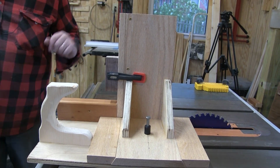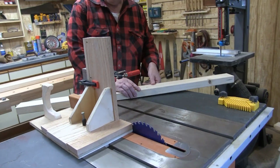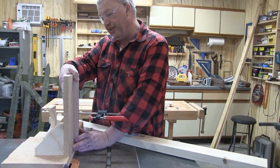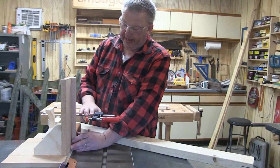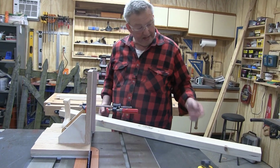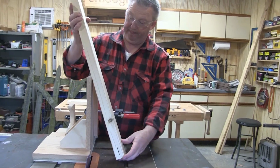And so if you come around here, I'll show you the setup on this side, and this will hold the thing upright. Okay, so I was careful to get this very square, and so it holds it upright, and I've fitted this clamp to it so I can hold the material steady. And because you're cutting across the end grain, which is always tricky. So here's how it works.